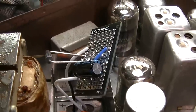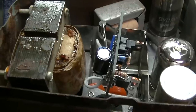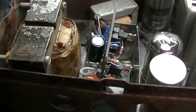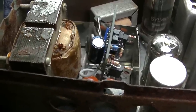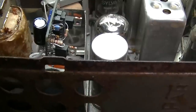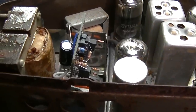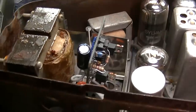What if I put one diode and one Schottky? I'd like to get that around 200. Here's the interesting thing - with the diode out of there, the FETs don't even get hot, they stay cold. With the diode there they get warm - it must be shaping the signal somehow. We're at 260 volts right now, which I think is probably acceptable because that capacitor is 350 volt and I was going to replace it with 400 volt. We run a little bit hot on the B+ but the FETs are only getting slightly warm - it's tolerable.